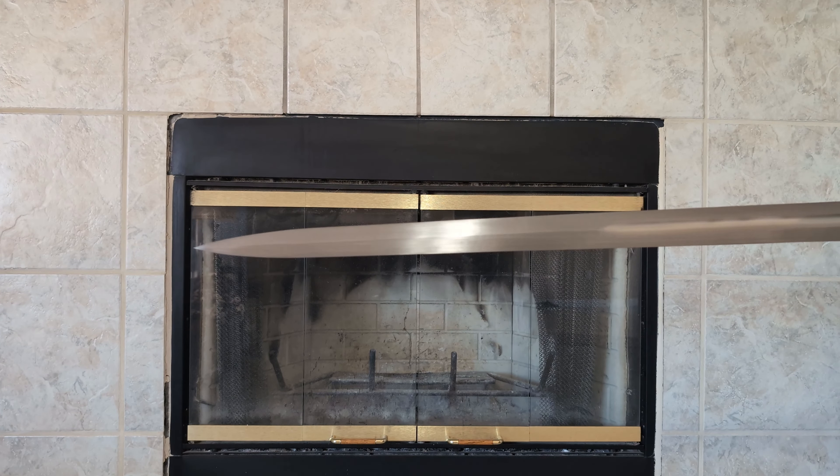It could be nimbler, of course, because of where it's balanced, but I feel like that's a good overall balance between cut and thrust. If I just hold it out here, the tip doesn't really wobble much at all — that's because this is a pretty rigid sword. You can see it doesn't have a ton of flex when I bonk the pommel, and if I go to flex it, it doesn't flex very much at all. That's because this is a relatively thick blade — it does have some distal taper, but it doesn't have a ton, so out towards the tip there's still a decent amount of thickness. That helps it maintain rigidity, which is going to help it in both the thrust and the cut, because having a rigid sword helps you power through cuts and is more forgiving of poor edge alignment.